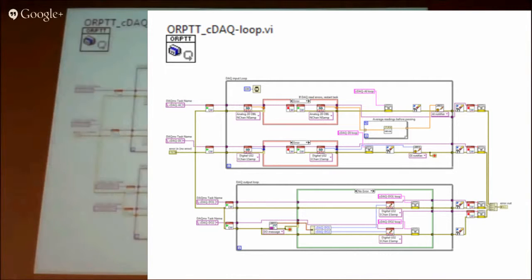Another benefit: if things are mapped out exactly and one channel burns out because you've shorted something or damaged it, then you're stuck. But with the configuration file we've got, we could change it in that text configuration file to point to a different channel. So that would be quite easy to do.